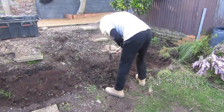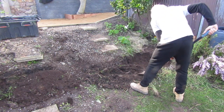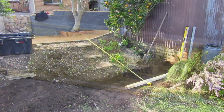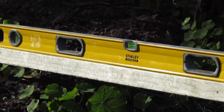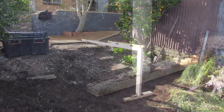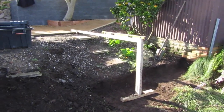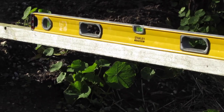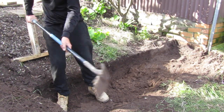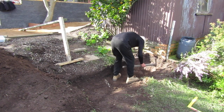Using my mattock and shovel I'm cutting a rectangle trench across what's going to be the bottom step of our staircase. After removing enough dirt to create a flat area it's time to get some measurements. Now that I know the length of the staircase, I'm going to make a jig to help me keep track of the level of this foundation that we're excavating. This jig will help me manage how much dirt to remove — I don't want to over dig because we want the soil to stay compacted when we pour concrete on top. The height of my jig equals four of our steps plus 100mm for our foundation, so by placing the level on top it accurately tells me when I've dug to the right depth.